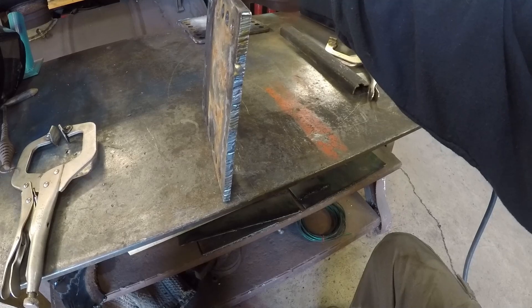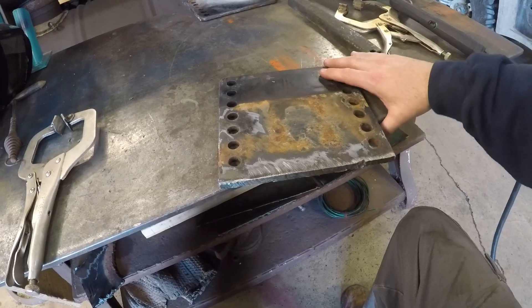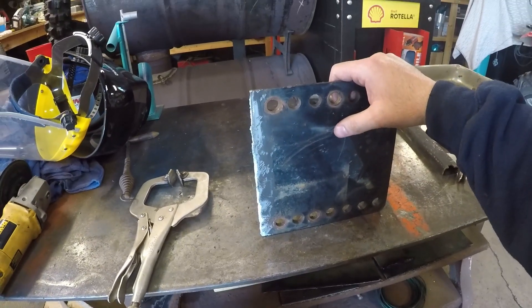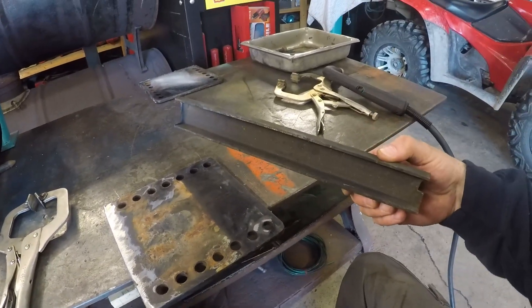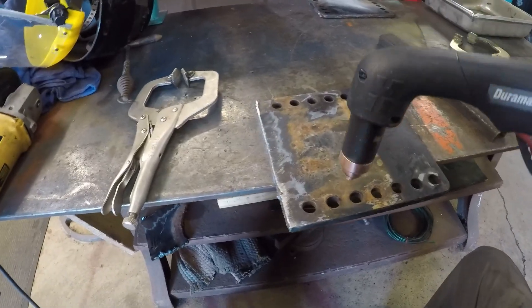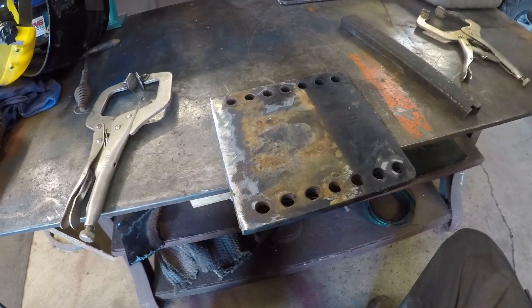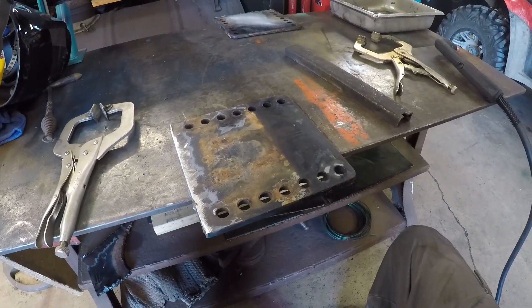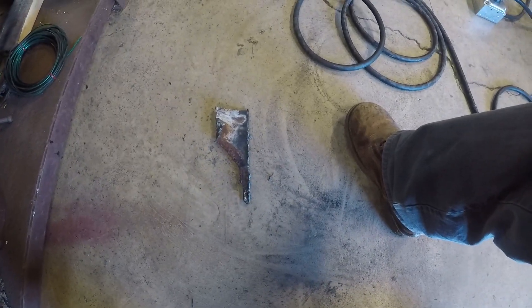It's hard to find a balance of how fast you should go. I just cleaned this up to make sure there's no sharp edges. This is 5/16ths plate and this thing blows through it fast — I don't really know how quickly I should be moving. I'm using this for a straight edge, which probably isn't the best idea. You just touch it on here and drag it along. It's definitely hot and it makes a huge mess.